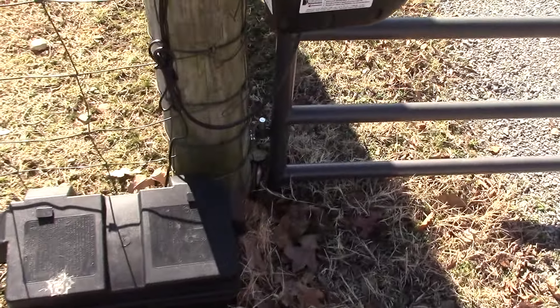I spent a whole day on the phone with Mighty Mule trying to troubleshoot — there's no way to fix the circuit board once this happens. What happened was my gate bracket on the mount came a little loose. I tried to tighten it, was playing with the gate trying to level it better, hit the button before it was level, it caught on the ground, and the ram kept pushing and actually busted the rear mount on the opener.